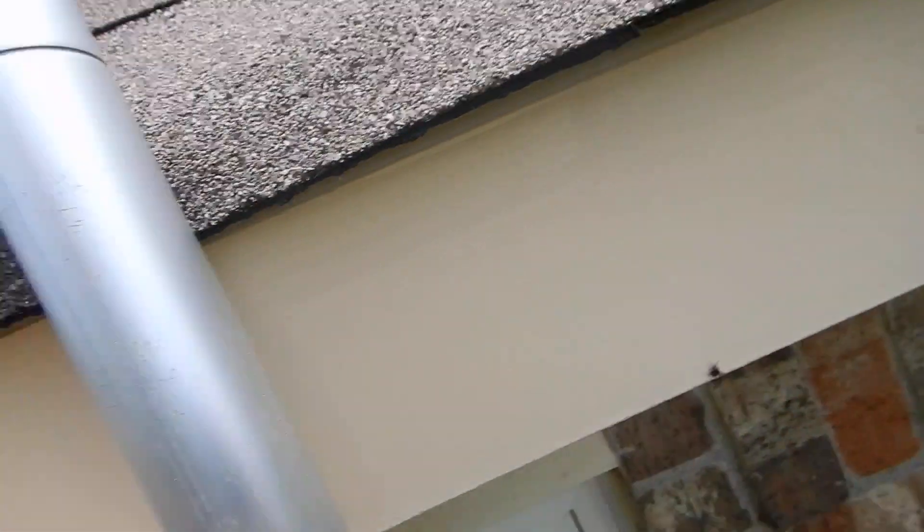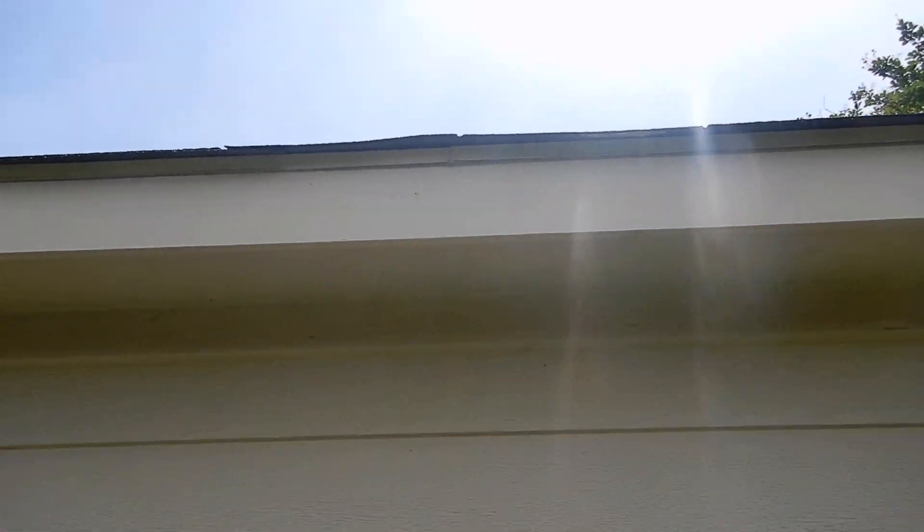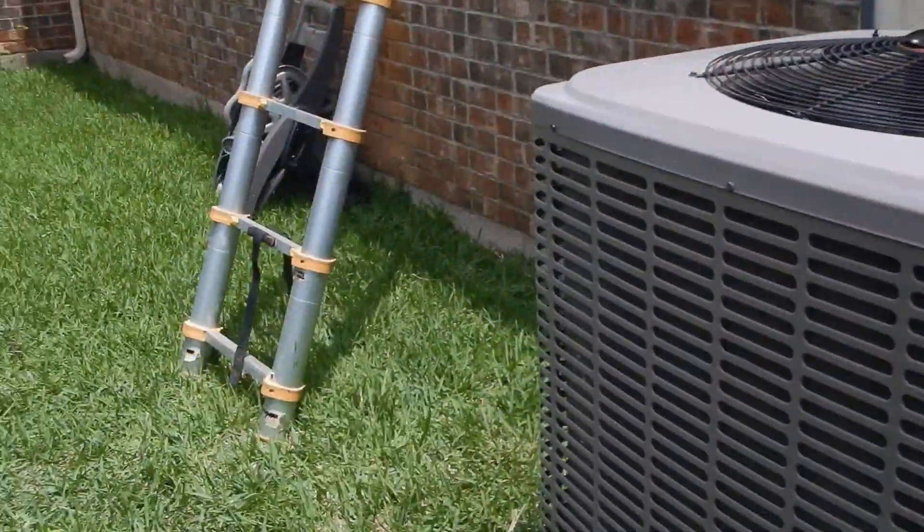You can see that the underlayment is on top of the drip edge — it's supposed to be like that, that's cascading. By the age and style of the underlayment, it tells me that this installation happened very long ago. Coming along here, remember why I'm showing you the underlayment: you get your shingles, your edge flashing, and then your fascia board — a little metal flashing right in there. It's supposed to be lapped a minimum of two inches, and that's what's supposed to have happened there.